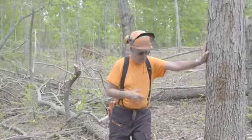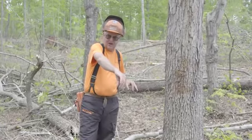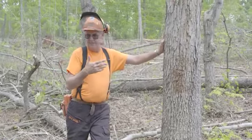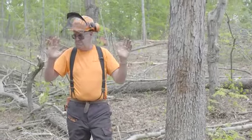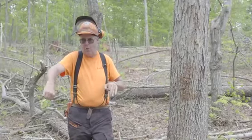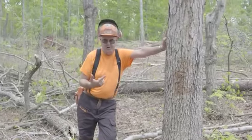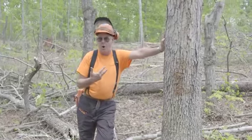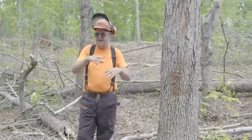Also, on your hinge wood, on this particular tree right here, I'm going to leave the hinge wood continuous across the stump, okay? The guys are allowed to take the centers. I call it knocking the center out of it, center punching it. It's perfectly legal to do, but what you're doing then is leaving two corners versus all the way across. I don't generally do that unless I've got export veneer, a very high quality export grade log, or the diameter of the tree is more than twice my bar length, because I need to get the center of that tree cut.